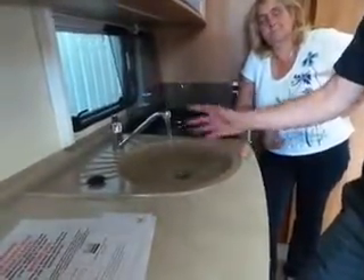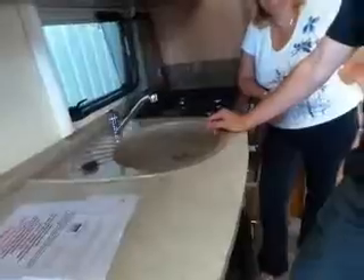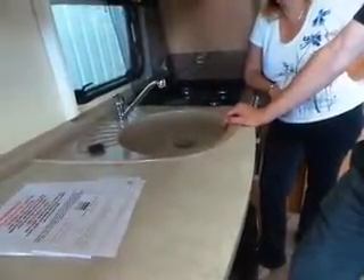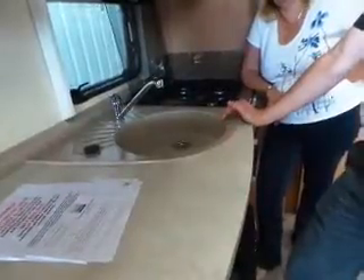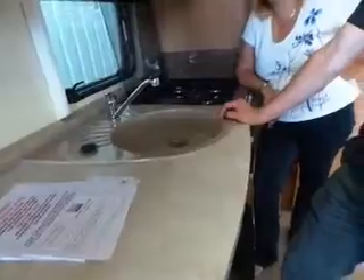Because it's all up and running, it's not instant heat. Once you've got a solid stream on the hot side, that means your hot water tank is full. If it's still spluttering, just give it a bit longer to get all the air out. Do the same with each tap to make sure all the air is out.